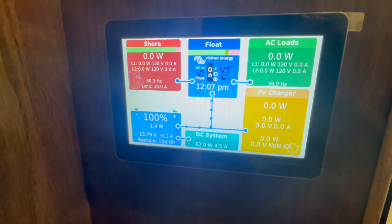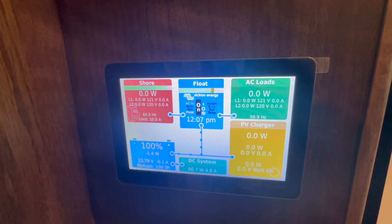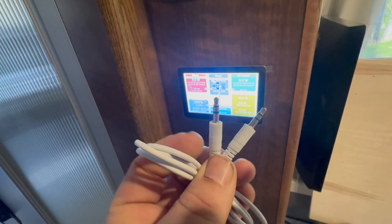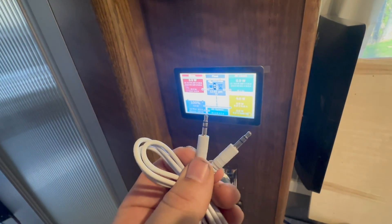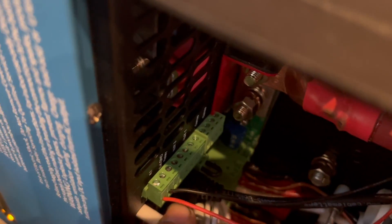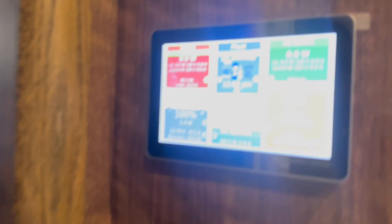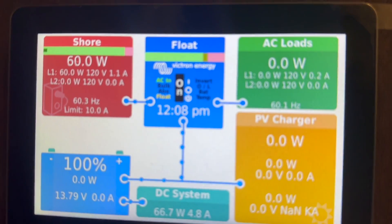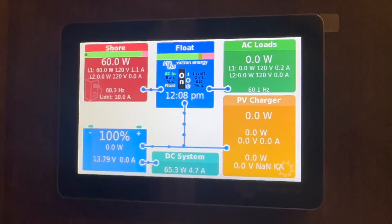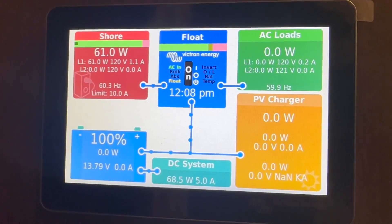One thing in particular: we've got no watt reading for input and output on AC. I'm going to try and use a headphone jack extender — you remember these? That's not USB or anything like that; kids, this is what we used to use to listen to music. On the MultiPlus there is a current sensor, right here. I'm going to pop that in there and out. We get no change at first — but there it goes, we're starting to get some numbers. That's probably all we're using: 62 watts. I almost thought it wasn't going to work, but if you're finding that's the issue, give that a try.